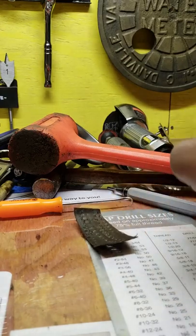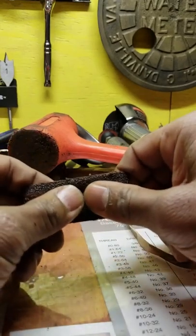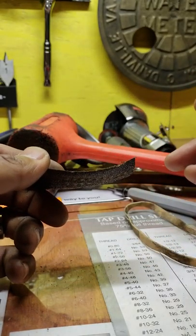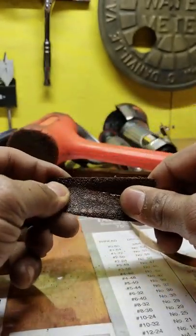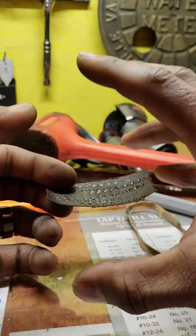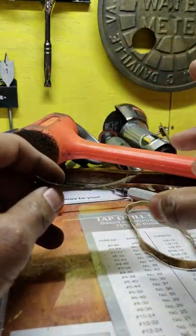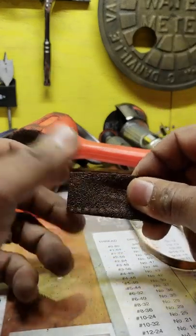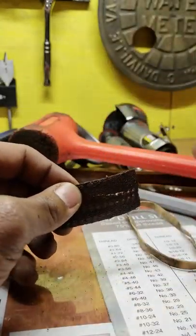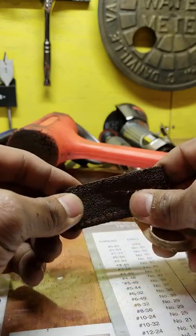Something else you're going to need is a little piece of sandpaper. I use sandpaper a lot when working on rollers or something you can't clamp tightly in your chuck jaws. I put it in all four jaws with the rough side down — that way it grips the part and prevents it from walking out of the lathe. Whether it's a piece of tubing or plexiglass, turning sandpaper upside down and putting it between your jaws prevents the part from walking. Also keep a batch of rubber bands — little odds and ends that come in handy.